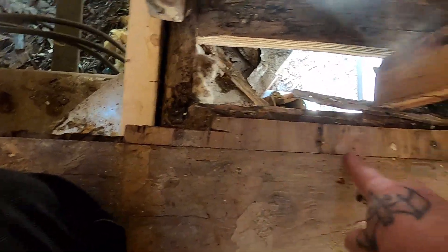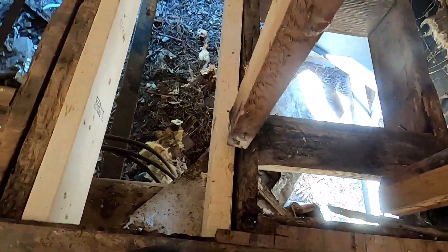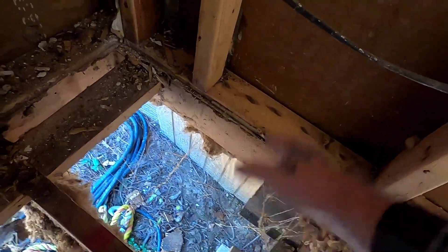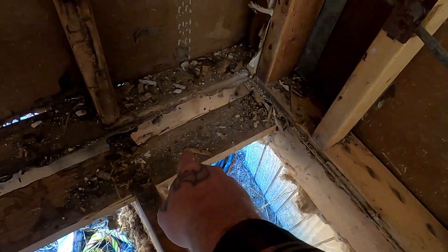This is the edge - this is an extra piece, just a little strip. We're going to take this line back even over here, and whatever's under these can move out of here. These are already floating in the air, so the new flooring or new sheet should go up under those. I'll have to tear out that bottom board. Anyway, we're going to prep to get some sheeting down. We have to do that in a few other places - find any nails that are sticking up in here. There's a nail sticking up right here, and there's nowhere to put the plywood over here because the flooring originally went under the wall. If the old stuff's rotted out and gone, you don't have anywhere to set new plywood. If I set a sheet down there's nothing to hit - that's what these blocking pieces were for from the prior repair work. This gives the floor somewhere to sit.